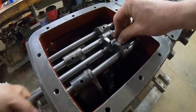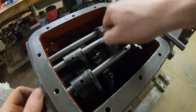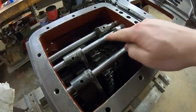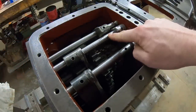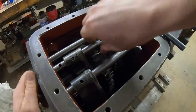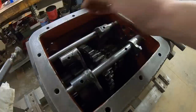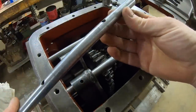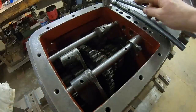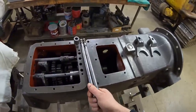Let's take this back apart. The two-three rail has the horrible bend in it, and the new fork is out. The number four shift rail also has a bend in it — likely damage incurred from that old shift fork breaking — so we'll take this rail out as well. That has a separate dog. The number four fork is not bent as bad but it still needs correcting, so that means we have two rails total we have to make. Out with the old, in with the new — tomorrow's work is ready to go. I'm going to get slamming on those rails and see if we can keep this ball rolling. Hope to see y'all back again.